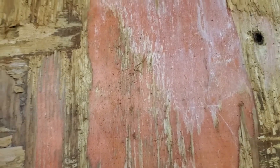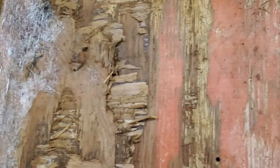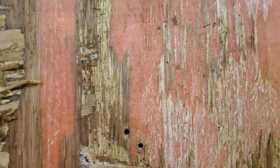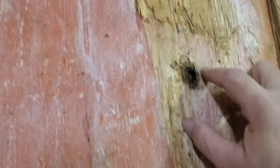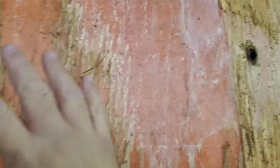I worked at Checkmate and I don't know why they chose to use plywood for these. What we're going to do is go back in with balsa — it's a thinner layer than the other one because you're not walking on this. There's actually a double-layer hatch; there's going to be another layer with upholstery bolted to this. You can see it's a whole layer of plywood with 1708 on it, and there's rot around that hole where water got through. Even then, if he doesn't seal up the holes when they're put in, it'll rot in that area again — but it won't travel as fast through the rest of it.